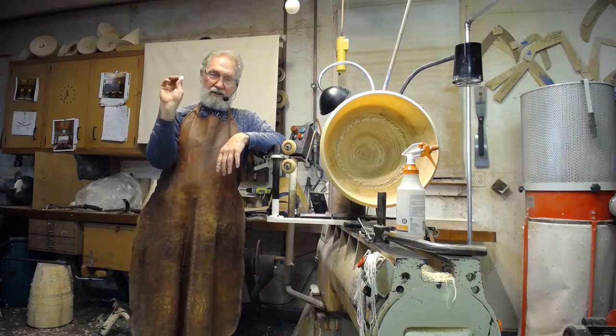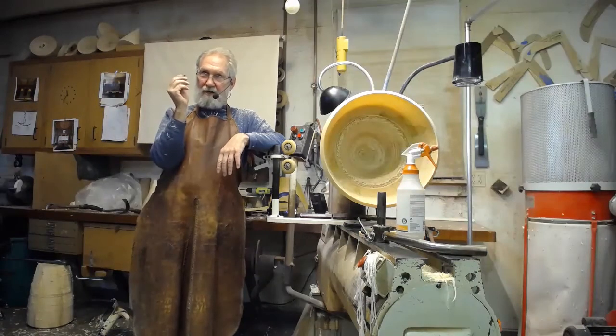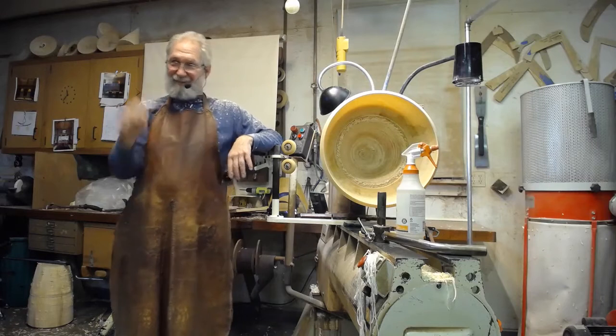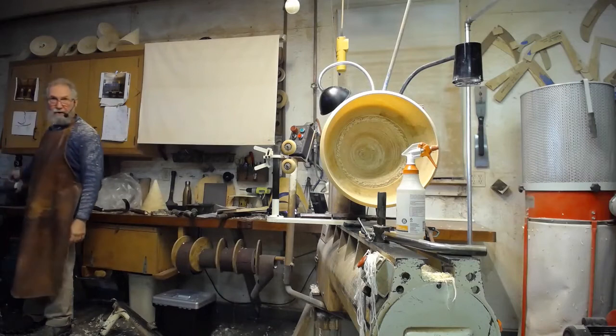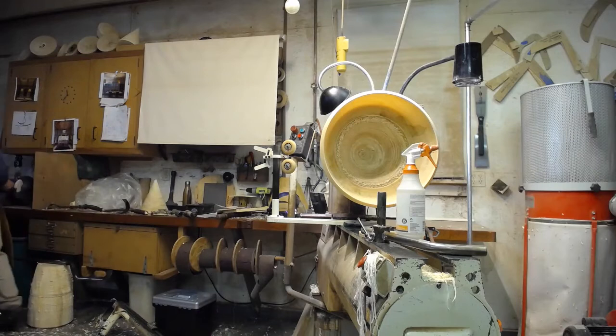And these cutters are all made out of an unusual steel called Tantung, which I think is also powdered metallurgy. Pretty expensive stuff, and it's hard to get it cut and ground, but high-speed steel will work, but Tantung is really cool stuff. Yeah, my grinder is always set at the same angle as this, so the sharpening process is really easy.